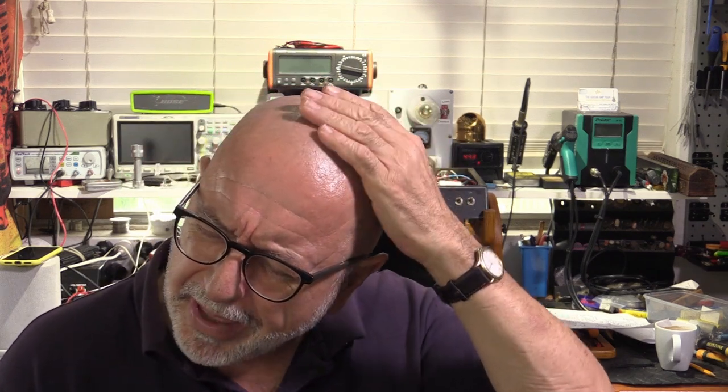The owner had given me a couple of secondhand tubes which were better matched than the pair in the amplifier. I put them in and saw what the plate dissipation was — it came out to around about eight and a half watts per tube. Now a 6L6 is rated at 30 watts, so 50% is 15 watts. This is less than 50%, which means almost definitely we're going to be seeing crossover distortion.